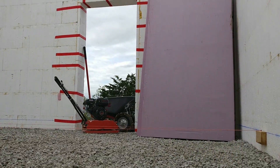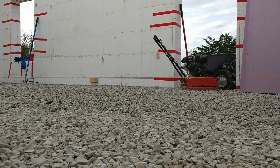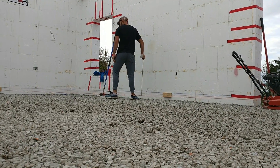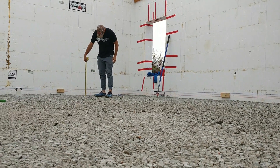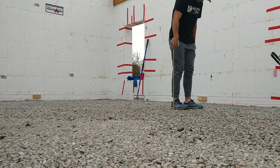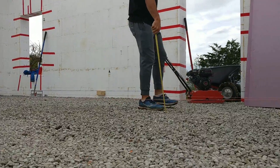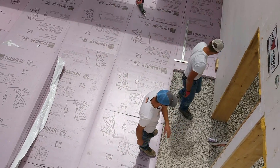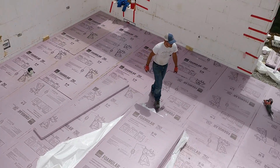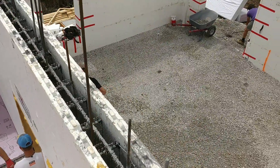The guys put up lines that go across in a zigzag pattern. What they'll do is go around and measure to make sure the floor is level — no high spots — because high spots would make our concrete thinner. As they go around to compact it, they're making sure we're still within tolerances so our concrete will have the correct thickness all the way around. It looks like we're going to have no problem meeting our deadline for tomorrow.